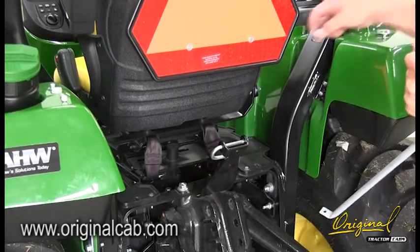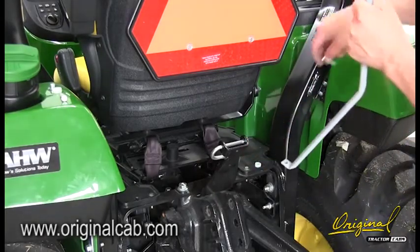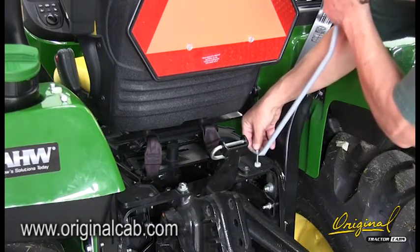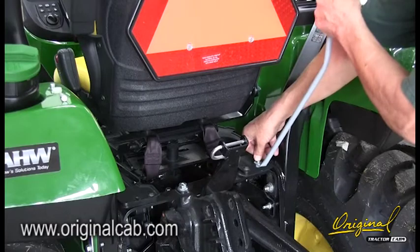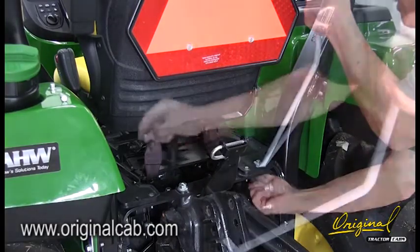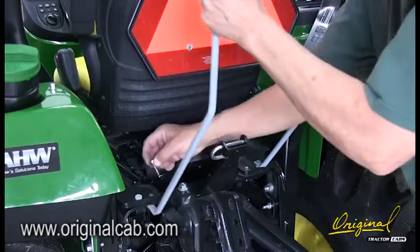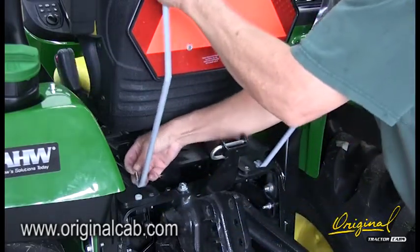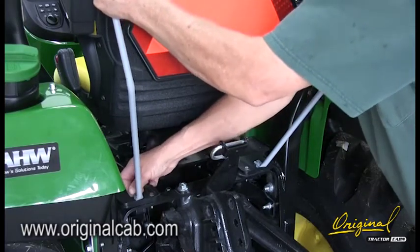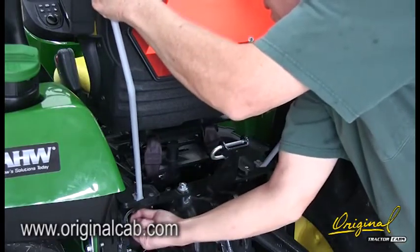Step 5, see figure 5. Install right and left rear boxing posts 11 and 12. A. Remove the bolts at reference C. Place a 5/8 by 1/4 inch spacer over the holes. Place the bent ends of the right and left rear boxing posts over the holes at reference C. B. Insert an M6 by 35 millimeter bolt down through the holes. Replace the nuts. Do not tighten at this time.